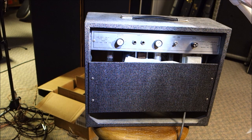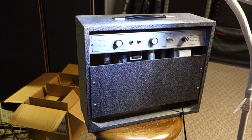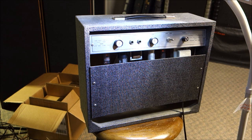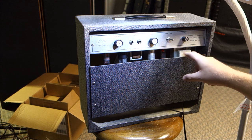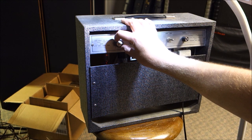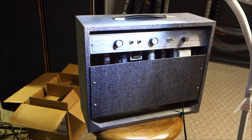I think we can make this thing work. Let's see the status of it right now. These are one of those amplifiers where money is every object. The tubes are glowing. There's no power light because power lights cost money. We have an itty-bitty output transformer because big, strong output transformers cost money. We have a 6X4 because a 5Y3 would require a 5-volt winding on the transformer, and that costs money. So yeah, it's on. It's humming. Lots of hum. A really crackly volume pot.